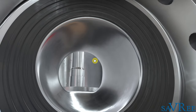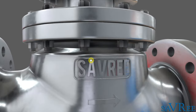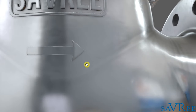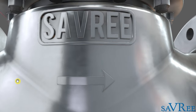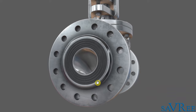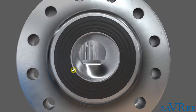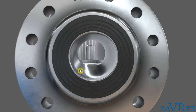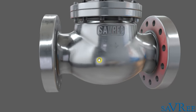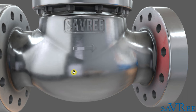We can see the inlet and discharge holes. On the side of the valve there is actually a flow indicator — an arrow — showing the flow is coming from the left and going to the right. That means on the left-hand side we have the suction or inlet, and on the right-hand side we have the discharge or outlet. Between the two flanges is the body of the valve, which houses the internals — referred to as trim.